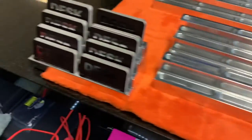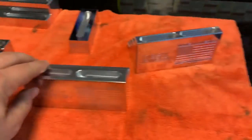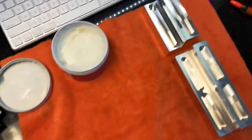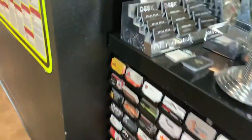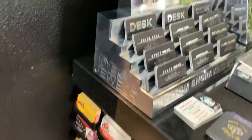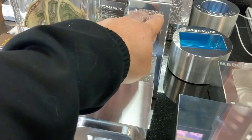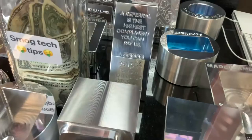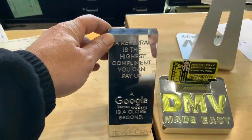None of these have been done yet. These are some of our other ones. This is what it looks like with business cards in it — these are the miniature versions of what we do. Here's a four card holder, a six, a nine, a single, a six for vertical cards, an eight for vertical cards, and we just did a two. This is machine polish — it gets really, really shiny. But if you notice, the definition in a lot of the letters is missing with machine polishing, because it takes some of the material out. Here's one that was polished by hand just like what you saw — the definition is a lot better in those.